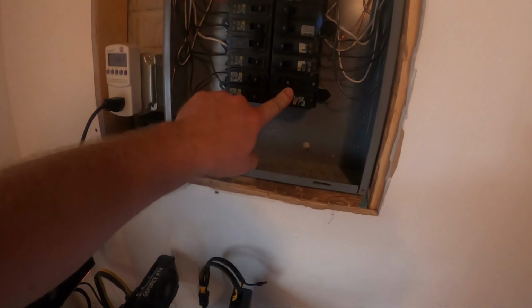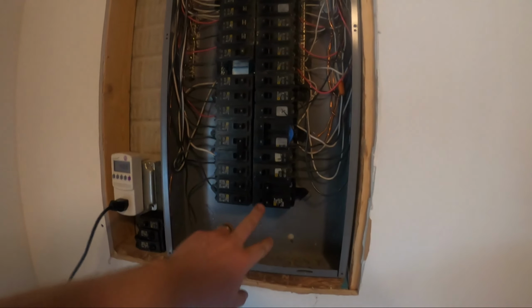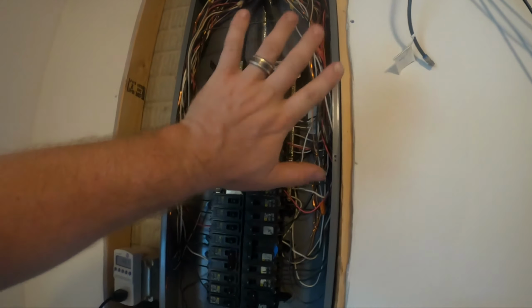And when I get down to this end, I had this big old 60 amp for a different project that it took out. Replace it with this 20 amp right here. They just click in where they need to go. So I gotta find a spot to bring it down through the top so I can get my cover back on and be official.